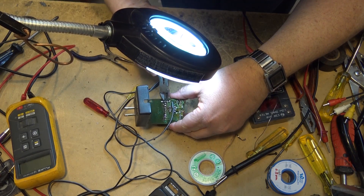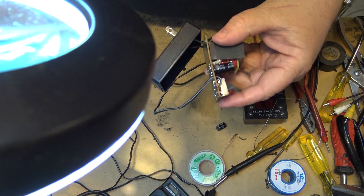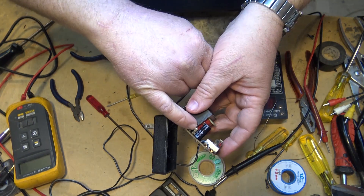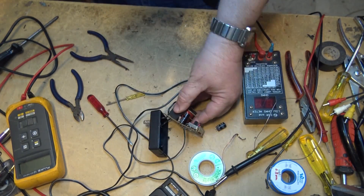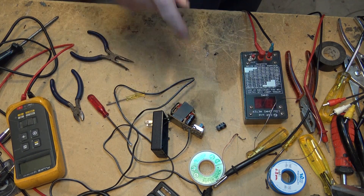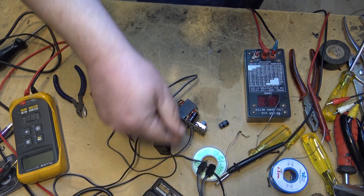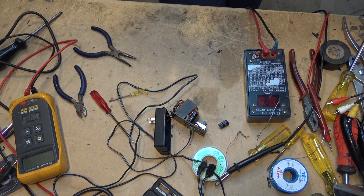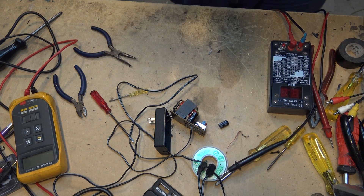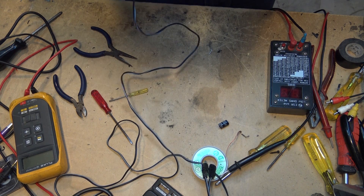At least they did a smart thing on the design of this — they put a bleeder resistor on here. There's a little resistor here; it's 650 ohms, directly across the capacitor. That's for discharge of the capacitor. So for example, if you've got this thing set to 12 volts and you drop it down to 3 — obviously if this capacitor is charged to 12 and it's not under any load, it's going to stay charged to 12. Then when you plug in something that's only needing 3 volts, it's going to go kaboom when you discharge the capacitor. So they have a resistor on here that discharges that. If you change the voltage down it'll drop that voltage down relatively quickly. But 650 ohms is not so low that it's going to draw a lot of power — you're not going to have a lot of wasted power in this resistor. It's just going to get that voltage down so that you can operate a lower power device.